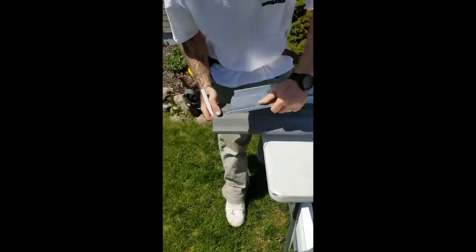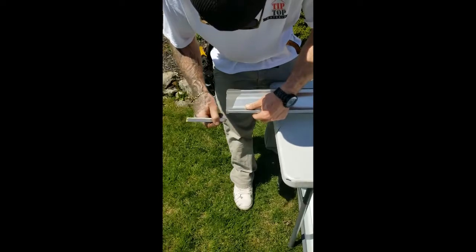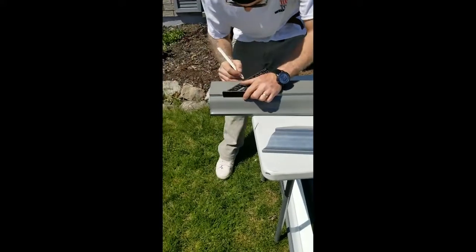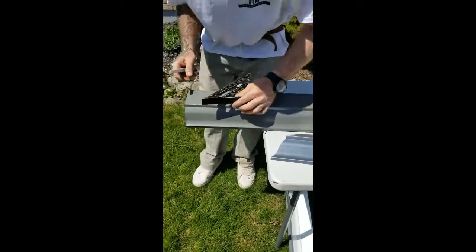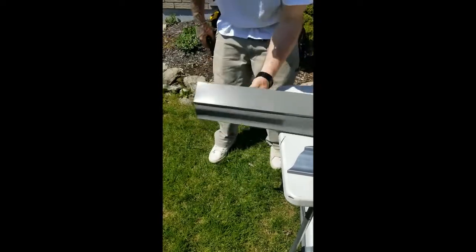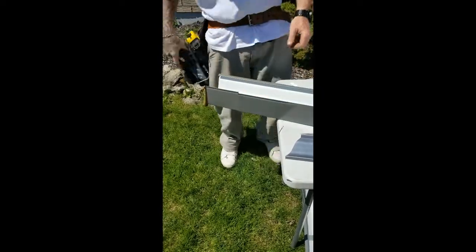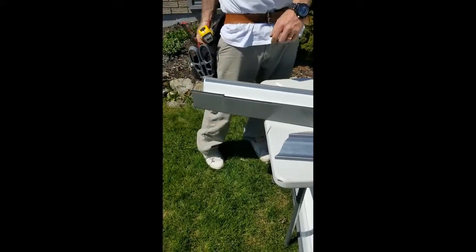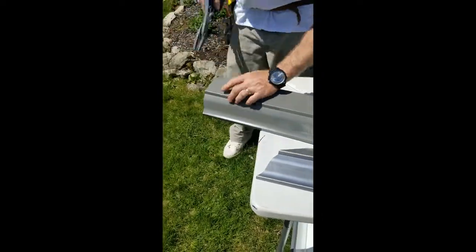First I'm going to take the template and make my face mark on this side. This is going to be the actual cut, so I'm going to make it so it's not sharp - come over a quarter inch. Bottom cut, then score it off. Once this is scored, I can make the cross cut to the front of the miter.